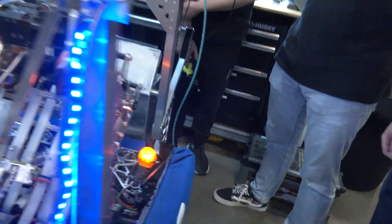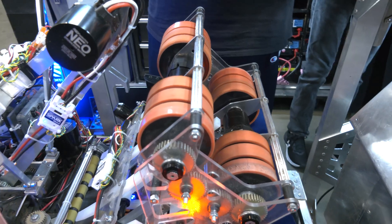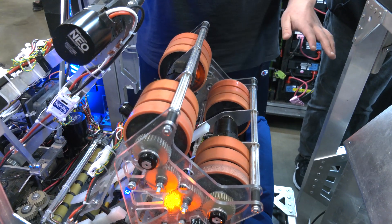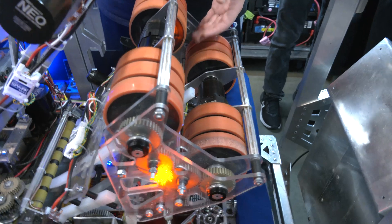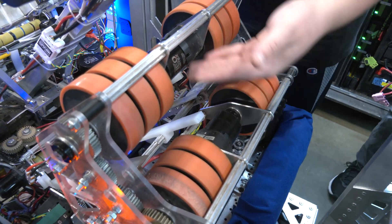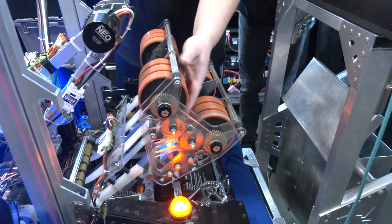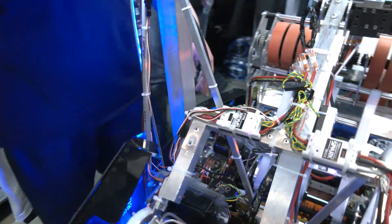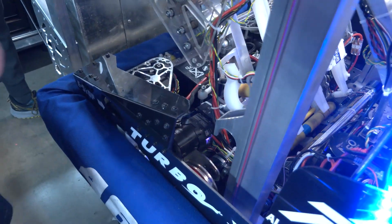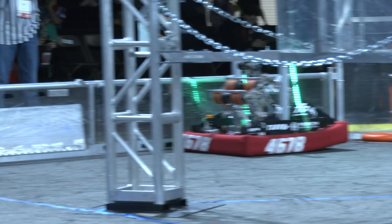Talk to me about your shooter mechanism — your wheel config and how your team got so accurate. Originally we had horizontal wheels; they looked like minion wheels, and during testing they were horrible — could barely shoot two feet. So we looked through research on Chief Delphi and other sites, made our own version, and added two Vortex motors since there was space and they're through-shaft. It's all one-to-one, with four gears transferring motion so each side spins independently to give the note a little spin. We also have a gas strut underneath to relieve pressure on the Vortex from pulling it up and down. When did you know the side-wheel system wasn't working? The first shot.